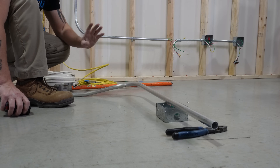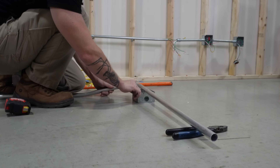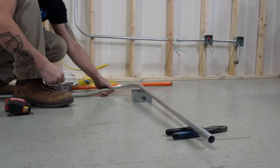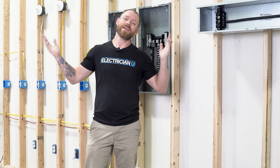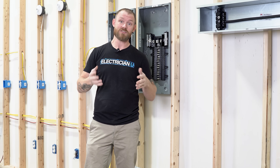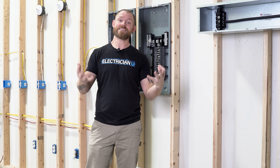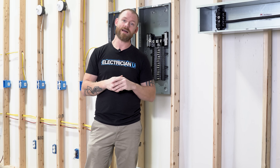But a kick is a nice way — if you can get away with it and there's no aesthetic reason why you can't have this much going over there, or your obstacle is super close by and you need to offset back down — there are a whole ton of reasons behind a kick. Kicks are really handy. They save you a lot of time and effort. It's really just a matter of figuring out what you're trying to clear. A lot of times you think you need to do two 90s, but you can get to the same thing by just doing a kick instead of a full offset or a whole other 90. Understanding when and how to use kicks is a super awesome trick to have out in the field.